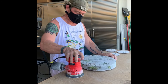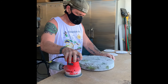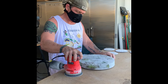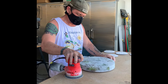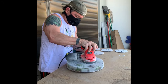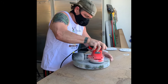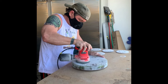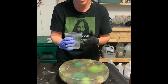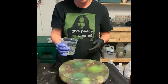We've got that table demolded. Tim's sanding it down now. We're starting at a low grit and working our way up to a high grit, almost to the point of polishing it. Then we'll go ahead and put a final flood coat or two over the top. For the flood coat, this is going to be one of possibly several with sanding in between. There's a lot of work in the finishing.